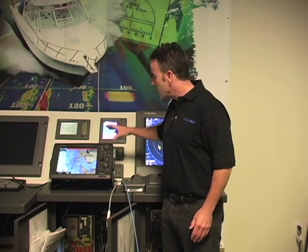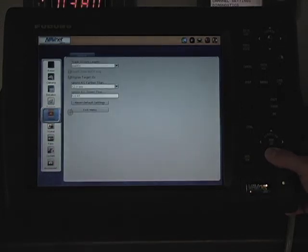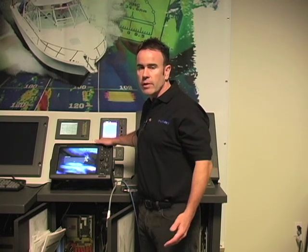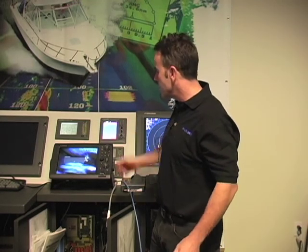Once you've satisfied those requirements, you can start setting up the NavNet 3D unit. All the setups are done in something called the wizard, so we're going to press the menu button to get into the wizard. With the NavNet 3D, when you initialize the wizard, it's going to be scanning the network for all components living on the network, so you'll want to make sure it sees the X7 series radar powered up. It's found one radar source — that's our confirmation that it's actually found the X7 series radar, which is a good and positive indication.